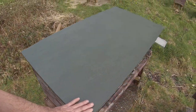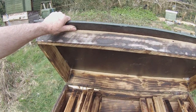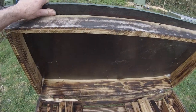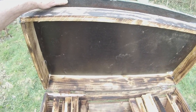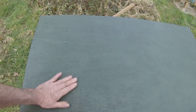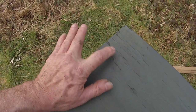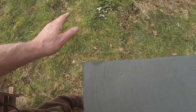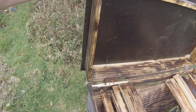This particular roof is made of phenolic ply, which is a coated plywood and is pretty good at shedding water. I don't know how long it's going to last, but it's not showing any real signs of deterioration other than expected UV deterioration, which happens to pretty much everything outdoors. I've recently given it a coat of paint. If I put the camera closer you can see fine cracks appearing in the surface, which will inevitably lead to some water ingress, so keep it painted would be my advice.